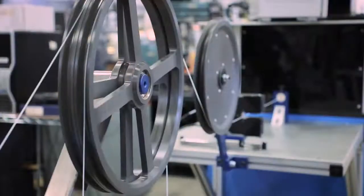In the past, testing these very high frequencies typically involved waveguides, which did not allow flexibility in test setups. Early attempts at higher frequency flexible cables resulted in fragile, unstable, and high reflection assemblies. Stormflex 047EW was developed to address these very issues.